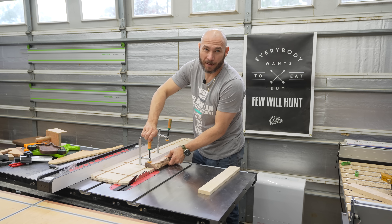This is a perfect tapering jig because all you have to do is line up the mark — the width on each end. If the top of my taper was two inches wide and the bottom was one inch wide, all you do is line up both of those marks on the edge and then just run it through. You can repeat this over and over, and you can even make stops to go in these grooves using the other hardware they have, making it easier to make repeatable cuts.